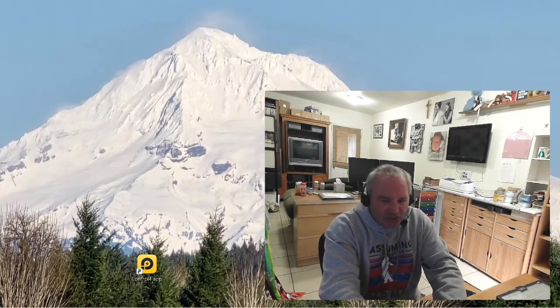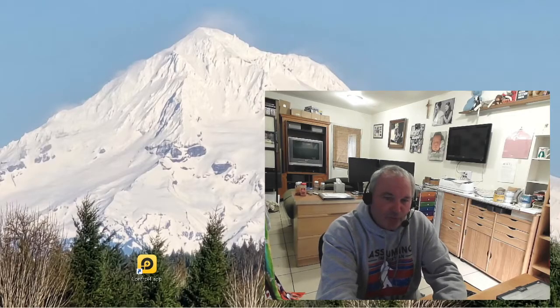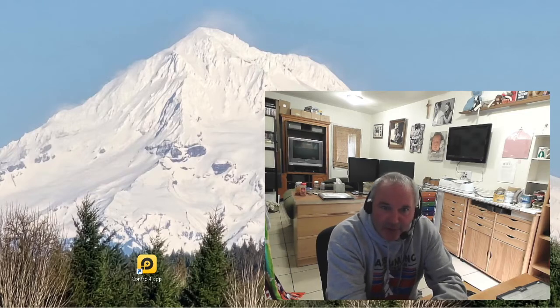We need about 950 RPMs on that generator to produce our 48 volts. Eventually we're going to feed it back up to the house and into our solar system to the inverter, to get some charging on those batteries at night. We've got five or six configurations of different size pulleys, and we figure out the rotation and gear ratio for each one.